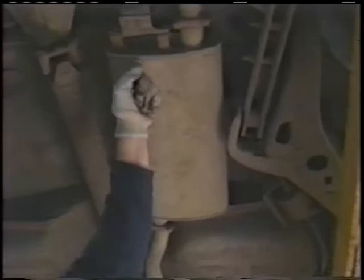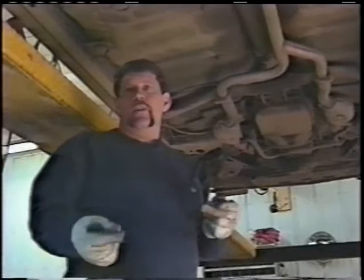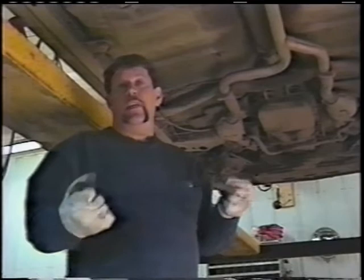You'll find with catalytic converted vehicles that what happens is they rust from the inside out. The three bad gases turned into three good gases. One makes water, and the other two gases make an acid. So you'll have more rust out from the inside out than you will from the outside in, most generally. That's why you need to check the baffle tubes.